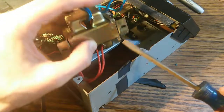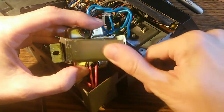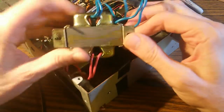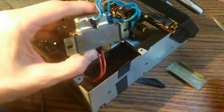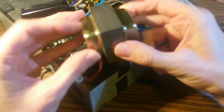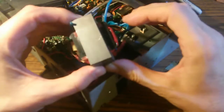It's all held together with metal tabs that are bent over — you have to pry something underneath them and bend them back. Once you've done that, you can pry the bottom off. There's glue in here; this stuff was all glued together and you have to break that glue — it might take some force. This outer covering, you have to get a screwdriver in there and pry it back, then hopefully slide it off the top. Then there are two coverings, one on each side, and those pop off, revealing the transformer. There's more glue, but now the transformer is exposed.